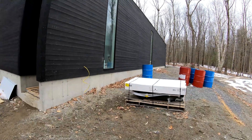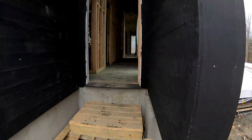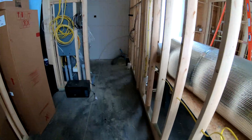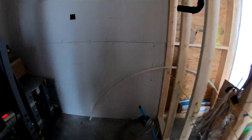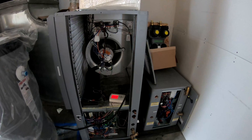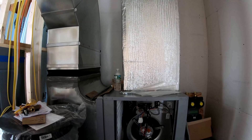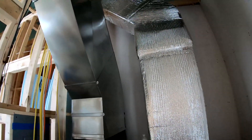It's still in progress — we're doing the ductwork right now. In the mechanical room here we have the Water Furnace 5 Series geothermal unit. That's the return there on the left, and then we have turning vanes in that fitting, and then I do 45s for better airflow on the return, sized correctly with the duct design.